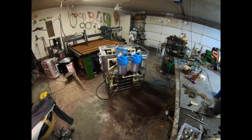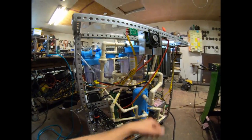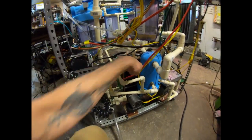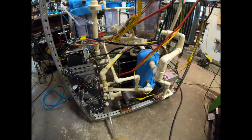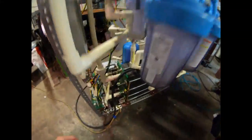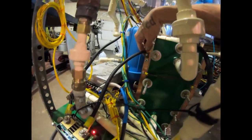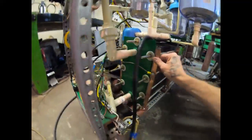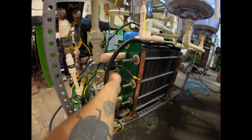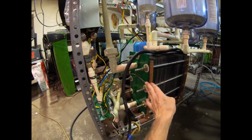I haven't used this thing forever — that's why we're seeing a little bit of rust in there; she's just been sitting idle. Other than that, everything's working great — no major foam-up issues, you could run this thing all day. A little warm, no leaks — happy about that. These copper bus bar strips are working out fantastic. Typically on a cell this size, if you just had a terminal hooked up, you'd get tremendous localized heating. There's very even heat distribution all down the sides of these tabs. I've done that to both of these — that's what that jumper wire is all about. We don't want to rely on the stainless steel to carry electricity into the center of itself.